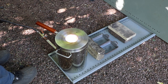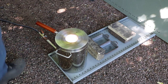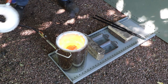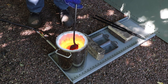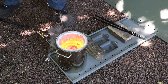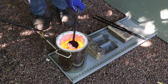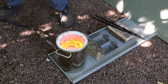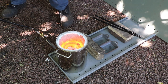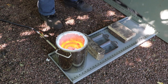About 10 or 15 minutes later all the aluminum is melted and it looks good, so I'm ready to shut everything down and pour it into the ingot molds. The long-handled spoon I'm using was not supplied — it's one of my forged spoons. You just need to clean off all the crud that doesn't melt and floats to the surface — it's called dross — and that gets you down to clean metal. Then you grab the crucible with the tongs and pour it into the molds.